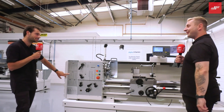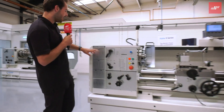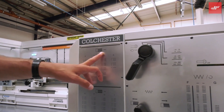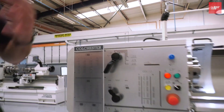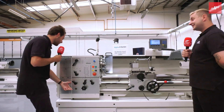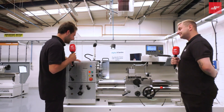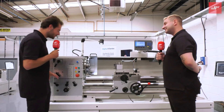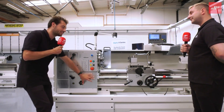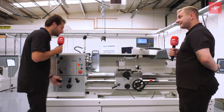You look at the big tables — what do you do with them all? You've got CR1W which will tell you how to do a .2 millirev threaded pitch, which sounds quite complicated, but you've basically just got to move these gears, take the clutch off, move these gears and then you get that thread pitch. It's quite daunting, but it's quite nice for students to understand how the machine will electronically actuate these gears rather than you doing the gears yourself.